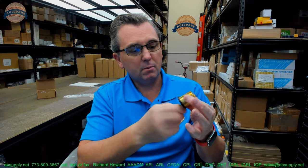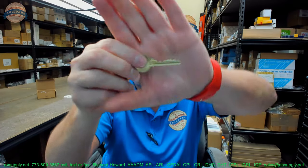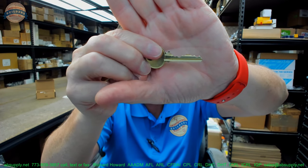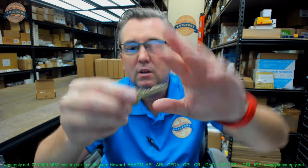This is made of solid brass, so it is going to be a pretty smooth operation on the key. This is a six-pin cylinder, and they have the key code — literally the bitting — on the bow itself: six, seven, four, one, four, five. If we were to study the depth of those cuts, the first one near the shoulder is a six, the next one a little deeper is indeed a seven. Yale is a two-step increment system where there are cuts zero to nine — that is a different conversation on the locksmithing aspect. Let's switch to the screen view now and take a closer look at the supporting documentation.